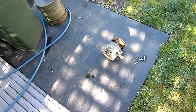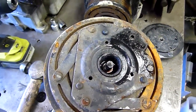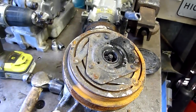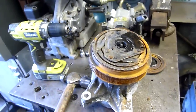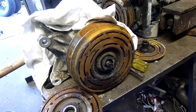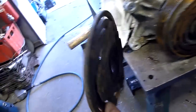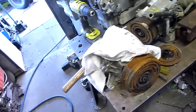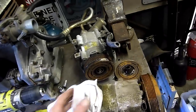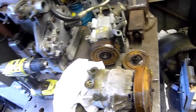All you do is make all the parts required to do the conversion, take the lathe out of commission, assemble it all, and away you go. We have a corrosion issue, so heat and auto-trans fluid should help get it out. This one's been difficult - it's just rusted on there, so I've got the hacksaw in behind the plate and cut it off. Just had to pry it away and buckle the plate out far enough to get the hacksaw blade in. The other option was to run a 9-inch grinder down this side and cut the whole front off, but the plate hub was accessible.